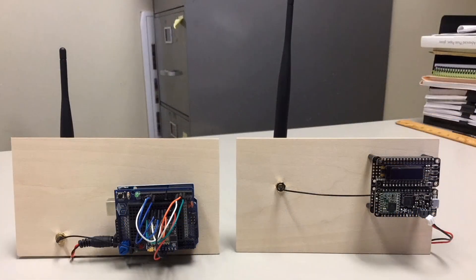In this demonstration, I'm using an Adafruit RFM-95W LoRa transceiver breakout with a cheap Arduino clone as my transmitter, and I'm also using an Adafruit Feather M0 with an embedded RFM-95 LoRa radio as my receiver. Both radios operate in the 900 MHz radio band, which is what's licensed by the FCC for use with LoRa here in the United States.